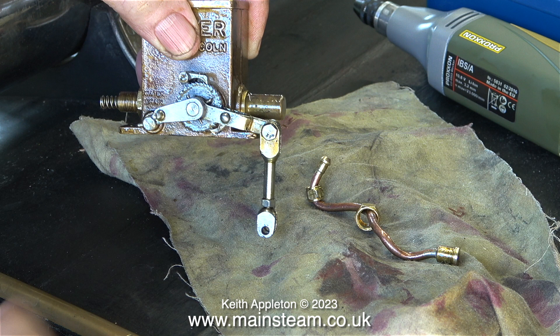When I first got this engine, it really was pumping a stupid amount of oil into the cylinder, so I removed the pump and modified it. This is the current removal, and the pipe's a bit of a mess, but it has to be bent around quite a lot of difficult corners.